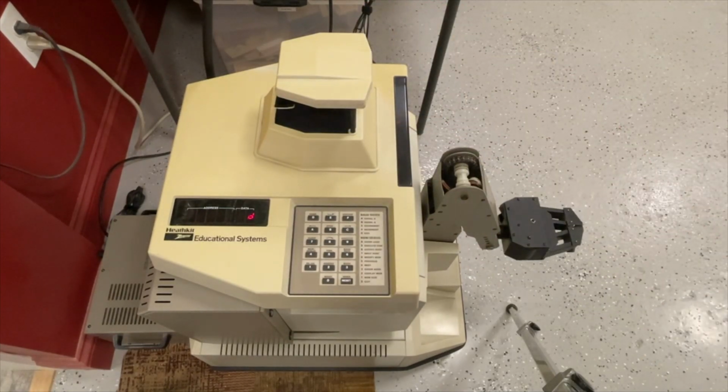If you don't hit the home button first before you get into the remote console, you'll get an error message saying the robot is not homed. Homing allows the robot to initialize each one of the servo systems that has limits and helps the robot keep from tearing itself apart. So it's crucial that you do the homing.